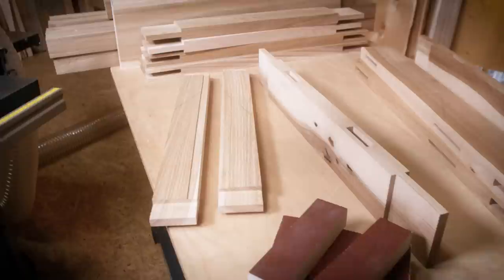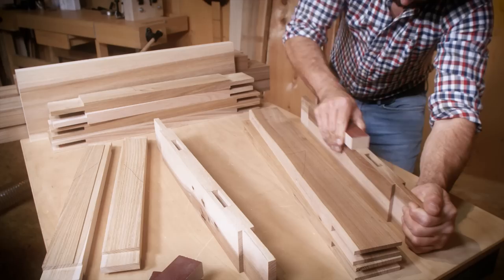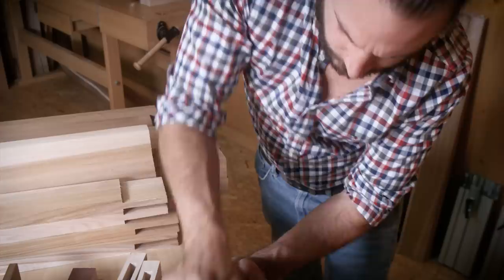Before we start gluing, we sand the inner edges manually, simply because it's easier done on the loose workpieces. Heli recommends gluing sandpaper to a piece of wood to avoid unintentional rounding of the inner edges. We use grit size up to 240. On our perfectly plain surface, this is done very quickly and easily.